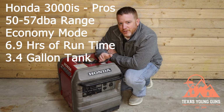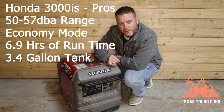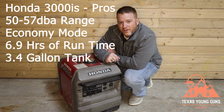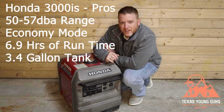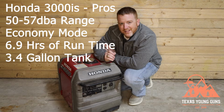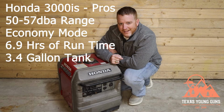Another cool thing about this generator is you have two modes of running. You can either run in a high idle mode where the generator is constantly revved up all the time, or they have what you call an economy mode where the generator can actually go down to the lowest idle that it can perform at. So in other words, if you have a light load, the generator will idle down, and I'll show you all that a little bit later.